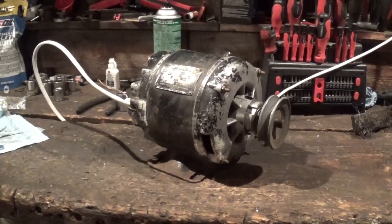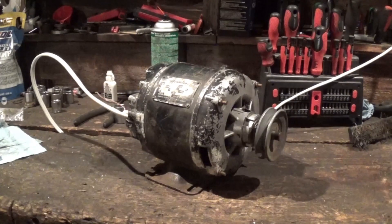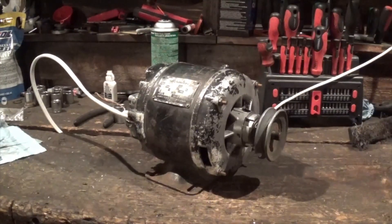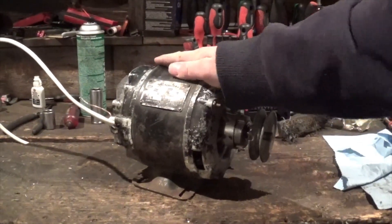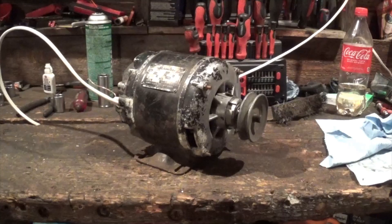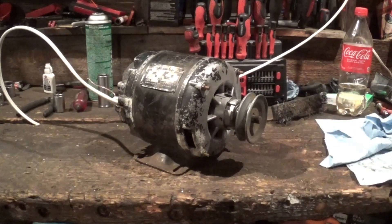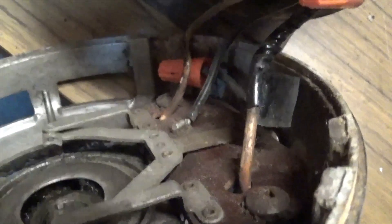No more awkward up-close shots - I've got a tripod nowadays. If the unit isn't in really good working order I don't like to touch it when it's running, because obviously we've got a shorted winding - who knows if it's shorting to ground. I left the ground unhooked just because if that is the case I don't want it to kick a breaker. Let's see if this old beast will come to life. It almost looks like it tried - I'm going to look at the footage. I just looked at the footage and I saw a spark blast out of here.